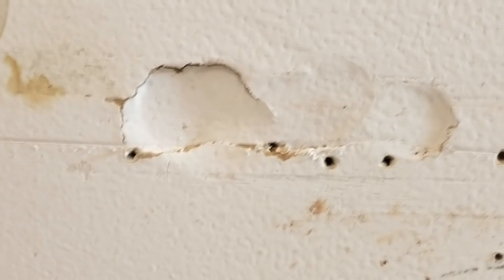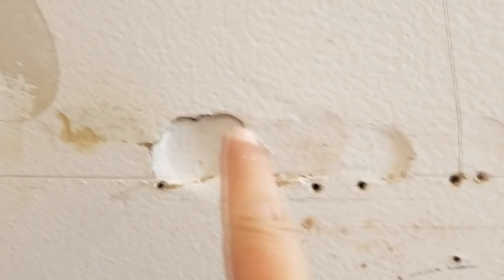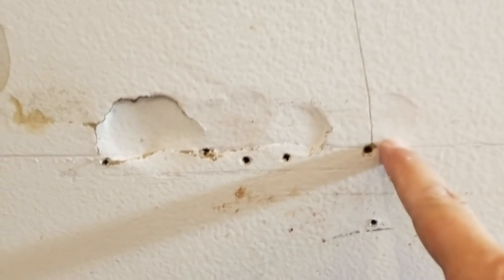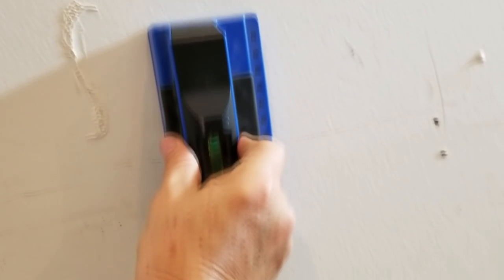And then likewise down at this end one here, you'll see there's another stud there. Yep. And then if you notice here, this is a phenomenon that the old school cabinet guys do. They can't find the stud, so they take their hammer and they bang, bang, bang until they find it, you know? And so it hits a hole here, and the closer you get to the stud, the less imprint you get there, see? And they didn't put any cabinet blocking in, so if I go here and measure down the wall, there's nothing there. So that's fine, we can go through the studs here too.